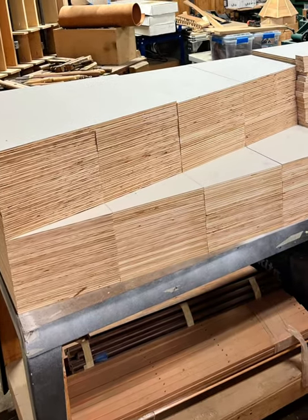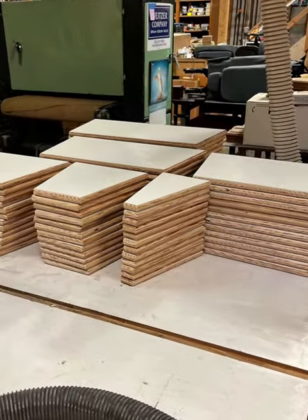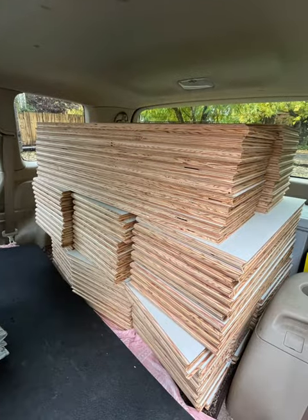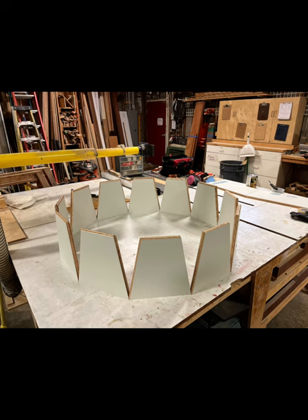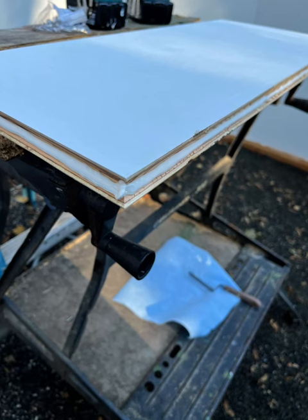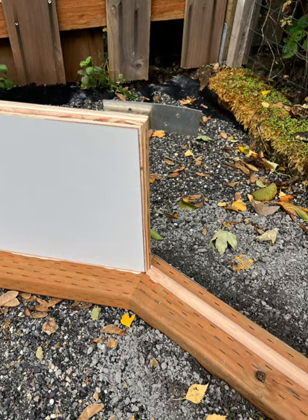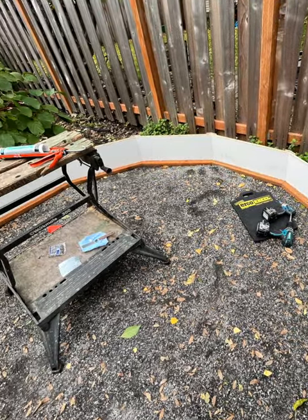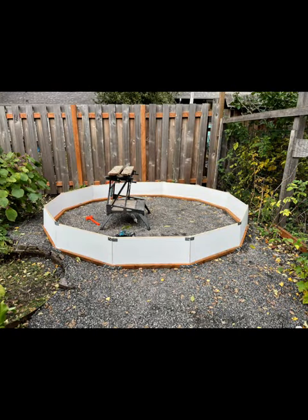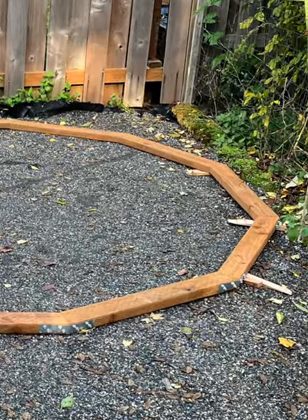Here are some of the construction details. Three-quarter inch medium density overlay plywood was used for the trapezoid panels — it took about nine sheets of four-by-eight material. The key to building the dome is that the seams are bullnose and cove construction. This allows a more mechanical joint and alignment, creating a greater surface area for the adhesive. Also, as the vertical joint angles change, the cove joint rotates without changing the basic milling setup. It has 12 sides and a diameter of nine and a half feet. The pressure-treated two-by-four foundation has biscuits in the miter joints.